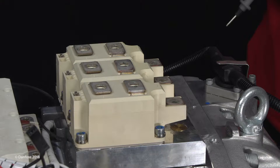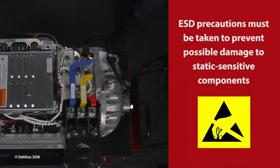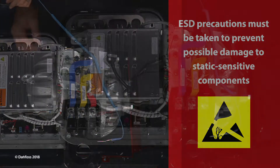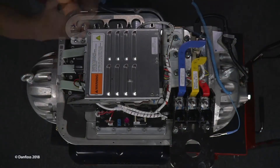To verify the SCRs, they must be isolated from the other compressor components. A grounding wrist strap must be worn when handling ESD sensitive components. Remove the soft start.